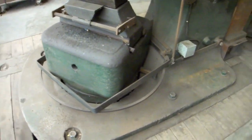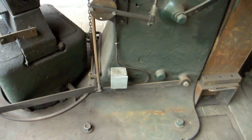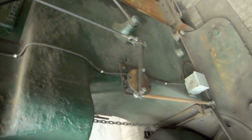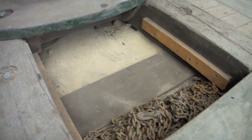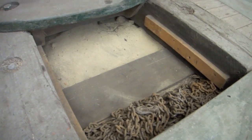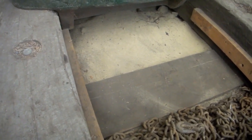Again, I fitted this with a treadle because I work alone — this is a later model hammer bossed for a treadle. The linkage has several adjustments for fine tuning; the treadle actuates the pump and the air valve through an electric switch and controls the amount of air through the tertiary valve. The hammer frame rests on two 12-inch timbers that are bolted and anchored in four places to the concrete piers, and the anvil is surrounded by sand as a fire preventative.